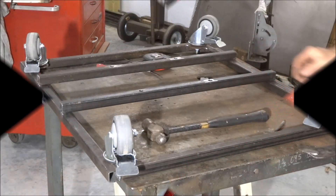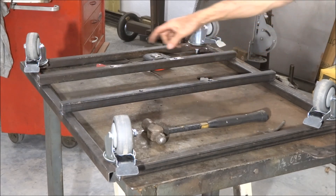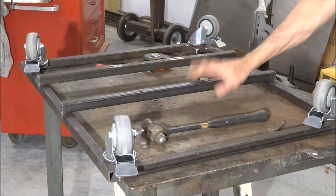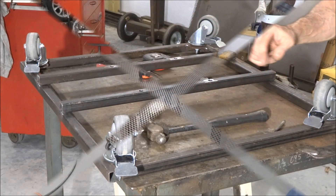I kind of jumped over making these two cross braces. That's just a matter of matching the bolt pattern on the stand that I already have. I've already tacked them in place, tested it, checked it — holds it right. So I'm going to finish welding it.